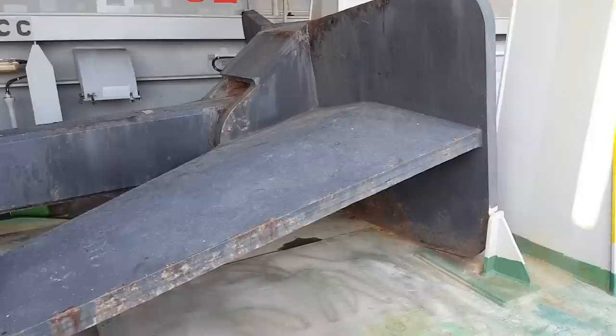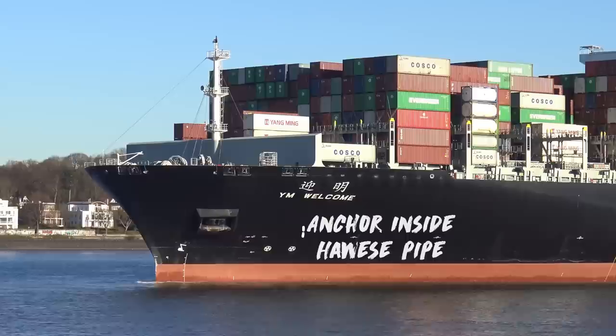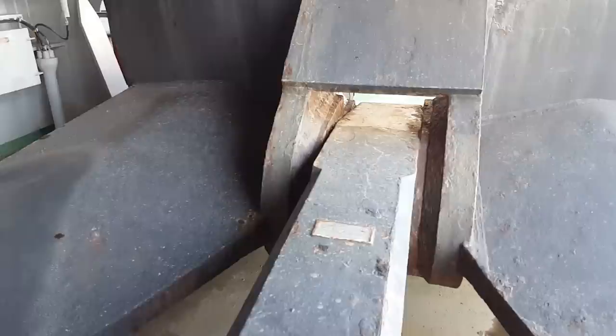So there's a lot of types of anchor out there. The most common type nowadays on merchant navy ships, especially large ships, are the stockless type. That's mainly because the design is flat and can be stored away easily. Usually you'll see it tucked away just beneath the bow. This one here is our spare anchor. A stockless type will have its crown, the arms, the flukes in one piece. It's designed to pivot on a shank. The shank is a term for the centerpiece.